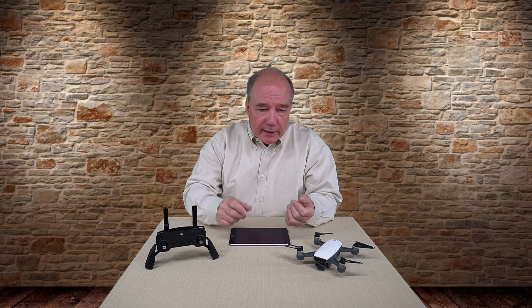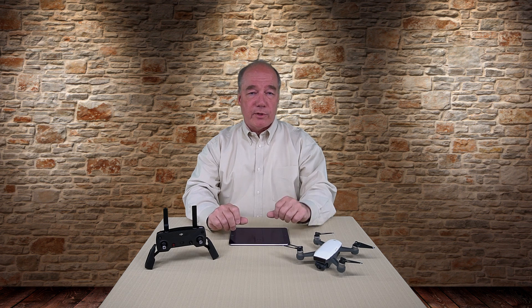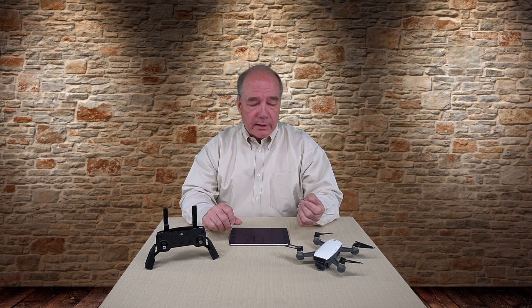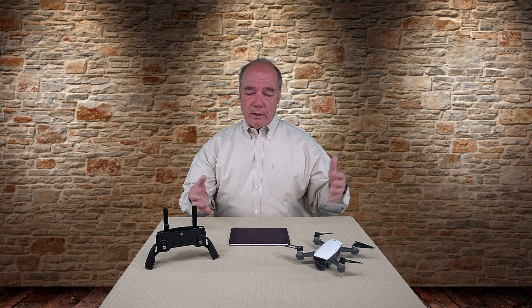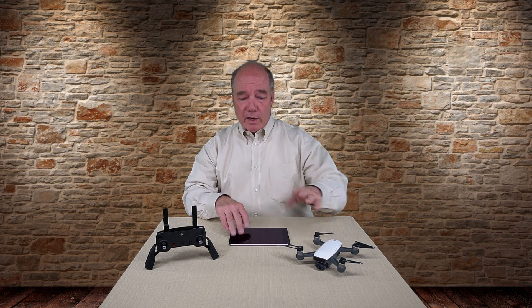The Bebop is a little less powerful at about 21 dBm, so it won't fly quite as far. But all of them kind of hit the wall at about a 1.2 mile range with Wi-Fi because that's limited by the FCC — you can't broadcast beyond that. In very simple terms, it's either bound or it's not. If it's not bound, you're talking from your tablet or phone to the quad directly, and you've got that limited distance of about 100 meters.